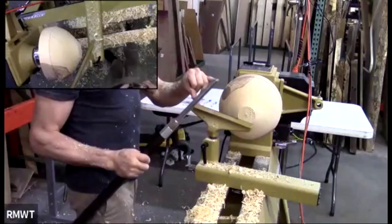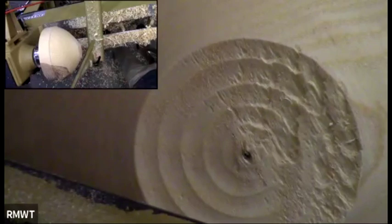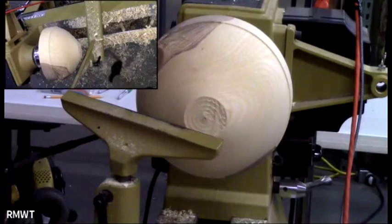So that's what I said before. Look what my wing did on this side grain here. Can you see it? It messed it up completely. That's where a bottom bowl gouge comes in, because that's side grain. This tool likes to eat side grain and put it on the floor. It does not like to finish it. It is an end grain exposing tool. And this one, if I can find it, my bottom bowl gouge is a side grain exposing tool.